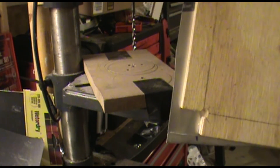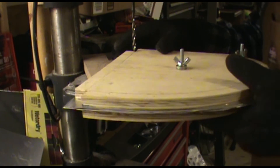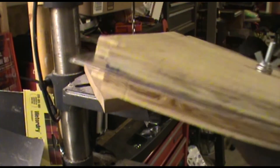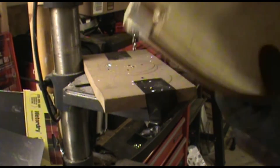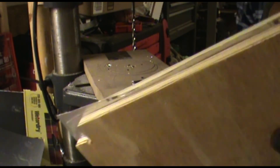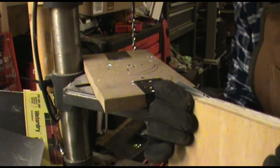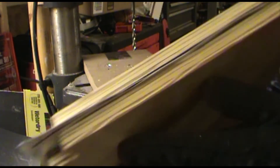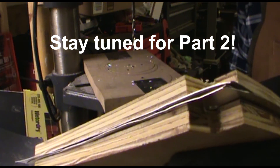These cutting templates actually have those relief cuts drilled into them. Without the material clamped in there, it's very difficult to drill those because they're on the edges, so I'll still hold this in place and drill these out. There's no backing block under that, but because it's right on the edge of the wood you're not going to bind against the hole - you're only going through the thickness of the material and it shouldn't climb up the hole on you. So you end up with your nice little holes where you've got them and now they're ready to be routed. I'm going to tighten these down a little bit more to get some more clamping force. There's a little bit of gap - that's metal warpage pushing against these cutting templates, but for our purposes that'll still hold and we'll move the camera and show you the router setup.